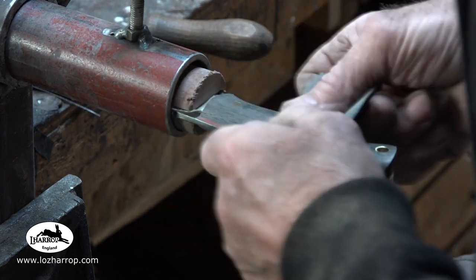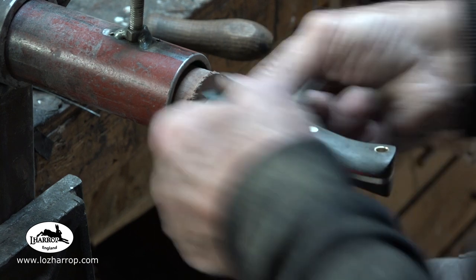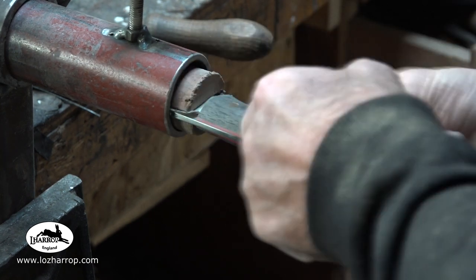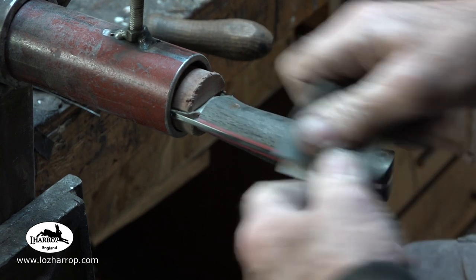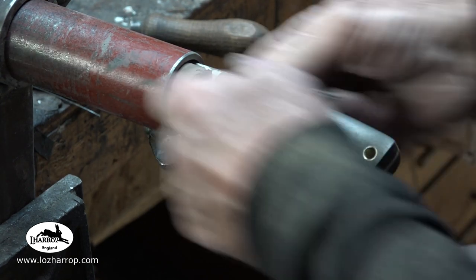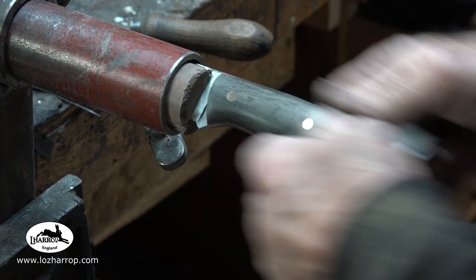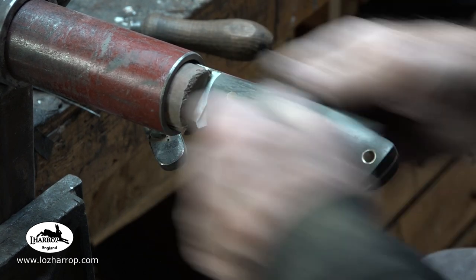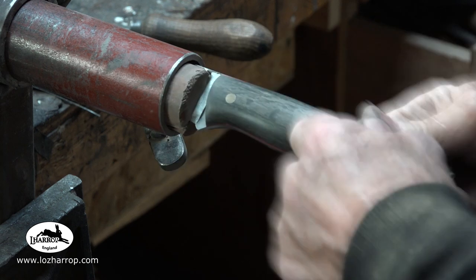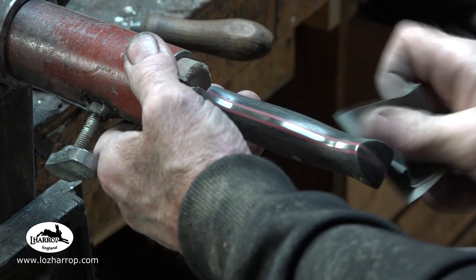I've done sanding, it's cleaning up now with micro mesh, polishing the wood, ready for a coat of oil. Before I do this, I do several treatments of water, which opens up the grain and raises the grain, and sanding and repeating, same kind of cycle. It leaves a lovely finish, just ready for oil.